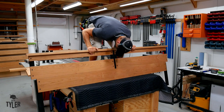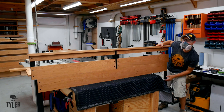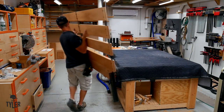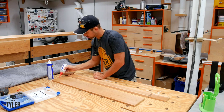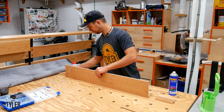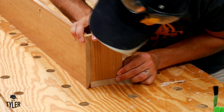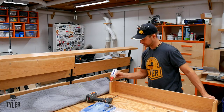Making sure it presses in place, I added CA glue along the entire top rail to hold it permanently in place. I used CA glue because wood glue will not stick since the finish has already been applied. And that is it for the footboard — looking good. The headboard was much the same, just bigger, heavier, and a little more unwieldy. The only difference is there are two shelves built into either side so you can put a watch, your phone, or any knickknacks you might take to bed. These shelves were quickly assembled using fast-acting CA glue, 18-gauge brad nails to reinforce that glue, and pocket holes to fasten the shelves into place. Now you might cringe at pocket holes in cherry, but they are a functioning joint that will work fantastic in this light load situation.